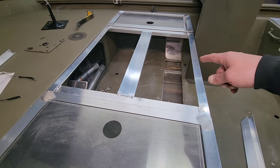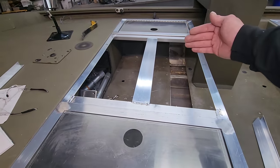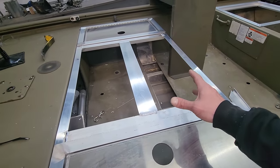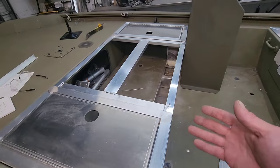I'm gonna wrap the live well with 1-inch closed cell foam on either side. It's 13 inches this way and 30 inches that way. That's gonna give us right at about 19 gallons full size and probably about 17 with what it's actually gonna be filled up to. So it's pretty good size. Should be able to keep his fish alive.